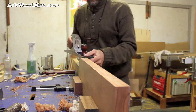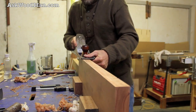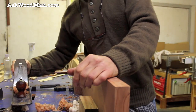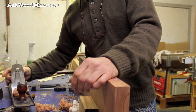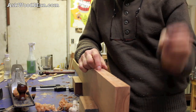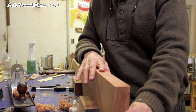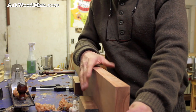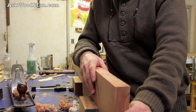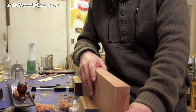It's a farm-raised wood that comes out of South America — a hybrid of several kinds of eucalyptus trees. The amazing thing is that whatever boards you get all come from trunk sections. I've ripped boards that are 16 feet long and haven't had one bit of pinch or deflection in the board. It's the most stable wood I've ever seen, but it's also so heavy and hard that it's almost impractical for furniture — you try to make a chair or a case piece out of it and you need a forklift to move it.